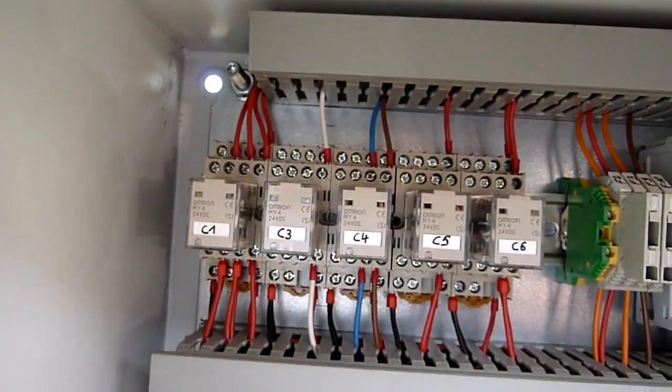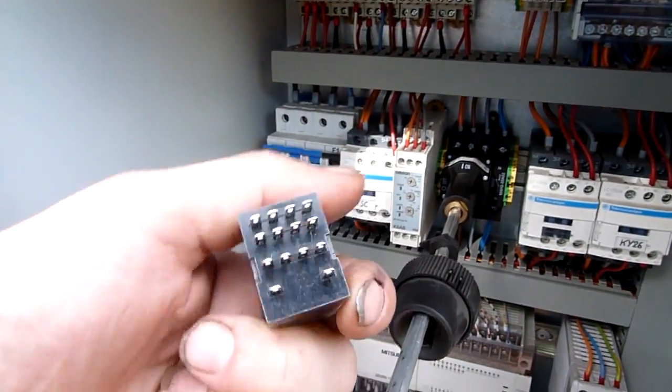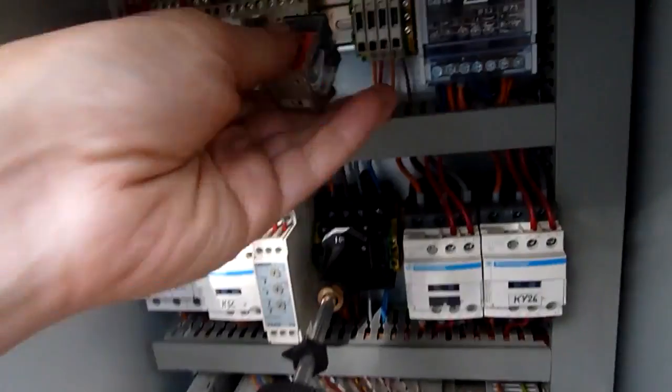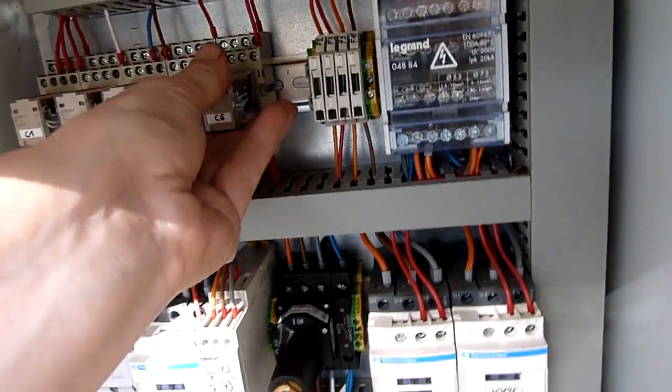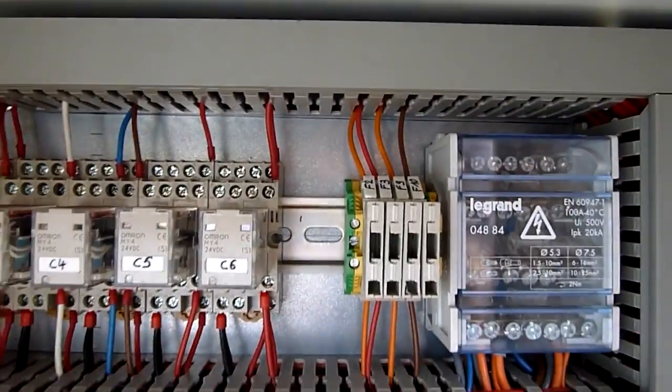These are decent quality Rittal cabinets, about seven or eight years old. The equipment inside is quite neat. You've got Telemecanique contactors — very handy, three-phase, you can use them for single phase, bridge and combine the poles for extra amperage, or get coils for different voltages — a lot of it's customizable. You also get relays: these are 24 volt control relays with bases, multi-pole relays, all DIN rail mounted. Keep the rails too.